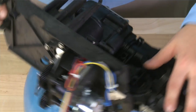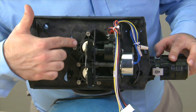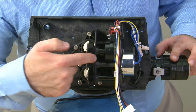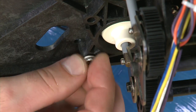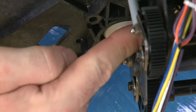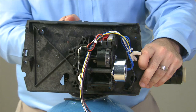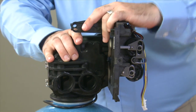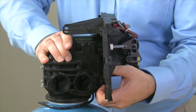We will then move to the front of the unit. To remove the back plate, we take seven screws out that hold the two pistons into the body, including two that are in the drive assembly. We can remove the five screws we have access to and loosen fully the two screws inside the drive. Once those are loose, we can start to pull the power head forward, using the leverage of the back plate to remove them from the assembly.